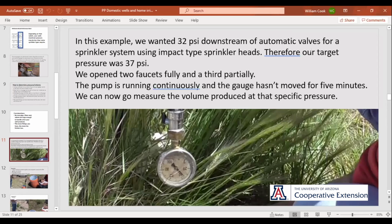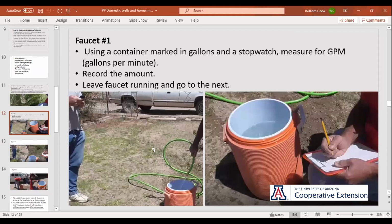If you're using sprinklers, you'll be able to see them. They'll spray like crazy, and then they'll just kind of dribble out and spray like crazy again. Besides the fact it's short cycling your pump, you're not getting even water, particularly, like I was saying earlier, if you're inclined to be picky about how much water you're using. I like to use exactly enough and not a gallon more and not a gallon less. And water pressure is a real big part of that equation.